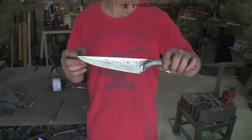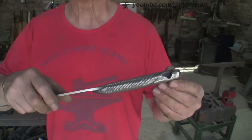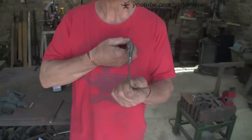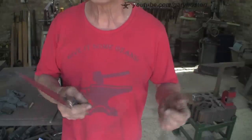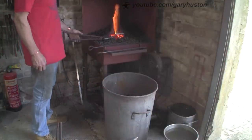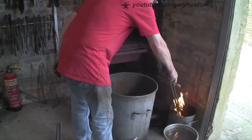I like that - the bevel is slightly bigger on one side than the other, but hey ho, it's only for me. Quite happy with the handle - rustic, but it's nice. It fits in the hand nicely. It's almost straight, that blade, not quite down the centre, but again hey ho. So I'm going to get this hot - putting it in spine first because if I lay the blade down it does tend to bow it.